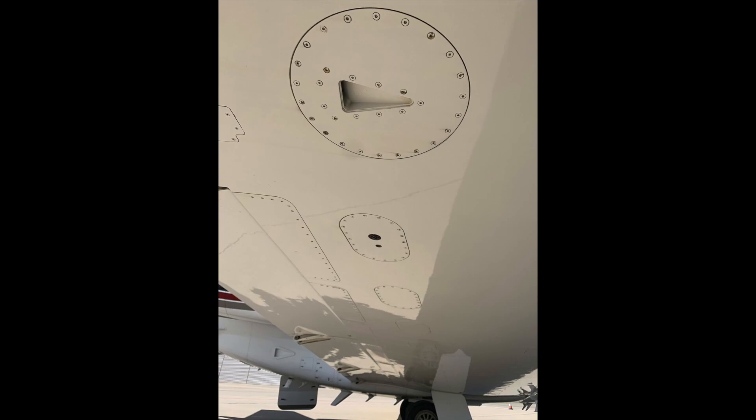Here is a picture of the fuel tank vent inlet scoop and the tank pressure relief valve. The relief valve is there for the rare case that the fuel tank vent inlet scoop gets blocked due to ice or anything. If that happens and you start to descend, you get into a scenario where the whole wing can collapse. So this valve actually prevents the collapse.